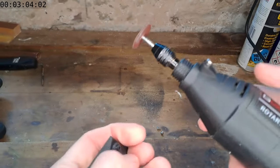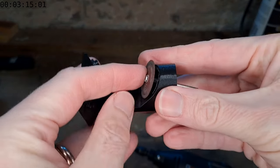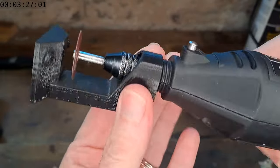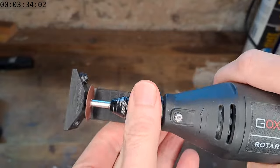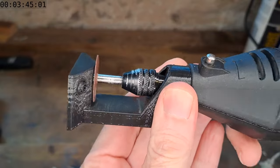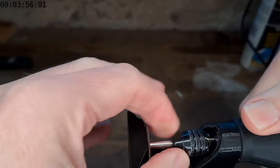Once you've printed the jig, assemble it as follows. Place your cutting disc on the mandrel and insert it into the jig, then place the mandrel into the chuck or collet and screw the jig onto the tool. The screw mechanism was a happy discovery — I originally did it just to attach the parts, but I realized it actually becomes a feed mechanism. You can move the cutting disc forward by screwing the jig, giving very precise control. Screw it all the way tight, move the cutting disc flush against the end, then tighten your chuck or collet.